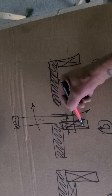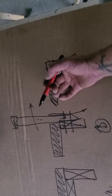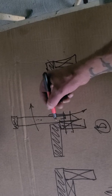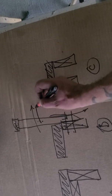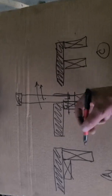And it's only anchored into your rim joist. Your rim joist is kind of cosmetic. It's structural in a sense, but it's only fastened to the very ends of your joists. So this is a failure point right here. You're not getting water damage, but you're fastening a structural piece to a weak point.